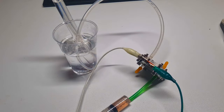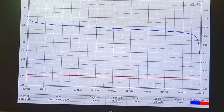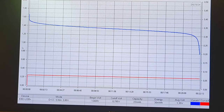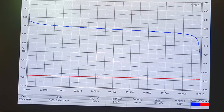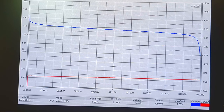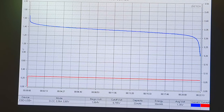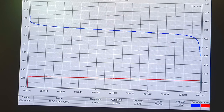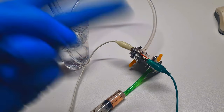For the end, I also discharged this cell with my electronic load. For the first test I got 30 mWh. The discharge curve is like a typical flat battery curve, which is really good. I charged the cell at 1.65 volts and discharged it at 60 mA, getting a runtime of 22 minutes and an energy of 30 mWh. So for the first test, this is okay. That's it for now — see you in the next video, bye!